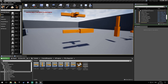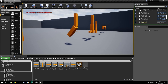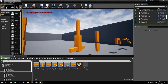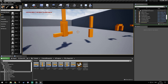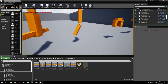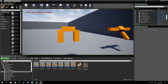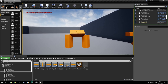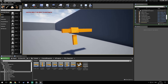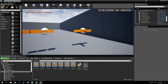We've got a linear joint right here that's just an object that slides in one direction. I've got a hinge joint that can swing in only one plane. I've got a twisting joint where objects can rotate around the other object. We have a ball and socket joint that can swing in planes and rotate. And here we've got two U-joints. And here we've actually got a combination of two joints — one is a linear joint and the other one is a rotational joint. So let's see how we can implement this.